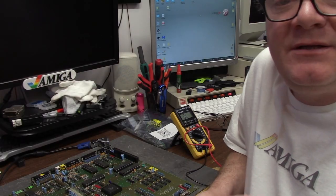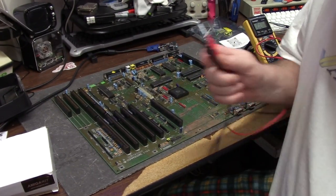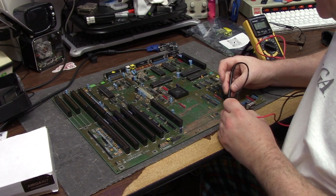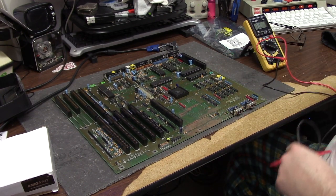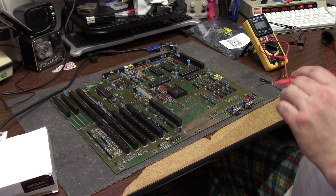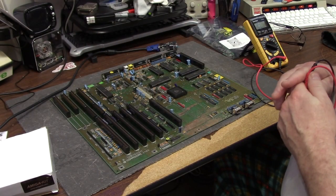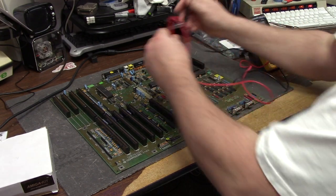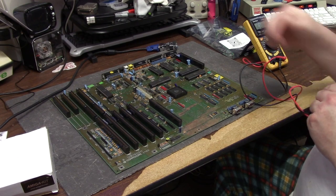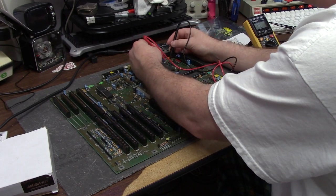When I get a board, I like to go around the fuses real quick — that would be a quick continuity beep-beep trace. On F1, your mouse — holy crap, it's good. Next is F2, it's back near the serial port — good. F3, which is on the back of the CIA next to F4, and F4 — and finally F5 on the RGB and disk drive port. This provides 12 volts for external disk drives.